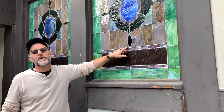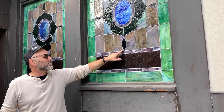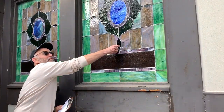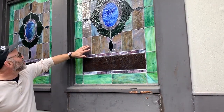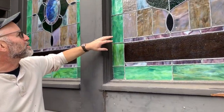So we would glaze this back together like this — we wouldn't glue it, because that's the way it was, and if we did, the piece would become too small. The ones we glue are the ones where you have a real Dutchman, meaning I can pull this piece away. Then we clean each piece, reassemble the whole thing with new came. The way we build this grid is a little different and we would probably use more reinforcing than they did.